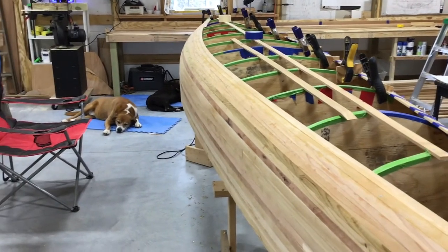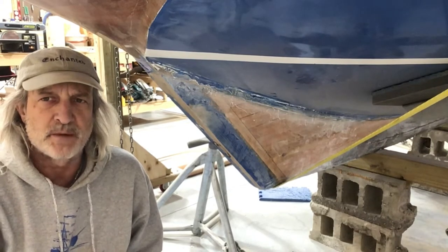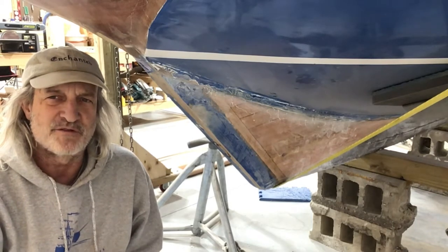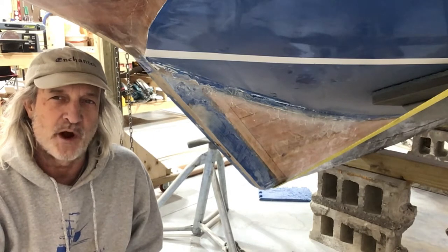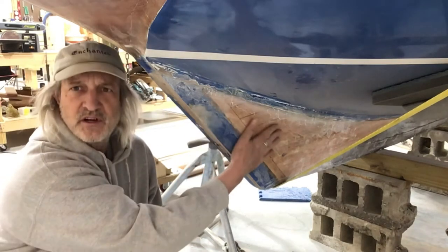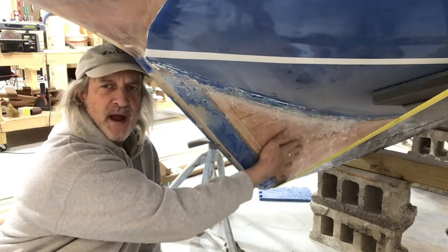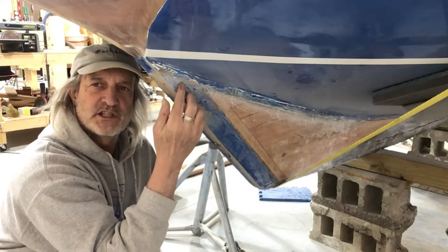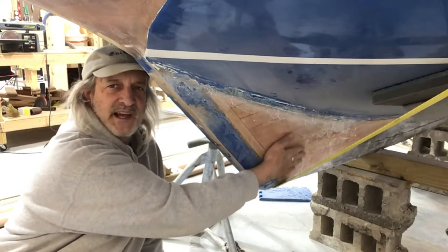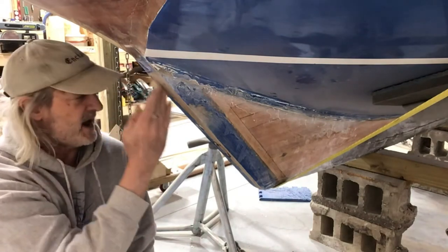Overall though, looking pretty good. The dogs are taking advantage of the nice warm floor. I'm waiting for the glue to dry on a strip for the canoe, so I'm over here working on the Haven a little bit. I know a lot of you who subscribe to the channel have been anxiously awaiting to see some more work on this boat. We sanded down the epoxy and I think I'm going to get a little bit of the Total Boat fairing compound and just go in here — it's actually pretty smooth, just a couple little holes we could fill. The other thing I'm doing is I never could get the rudder to hang on here just exactly right.